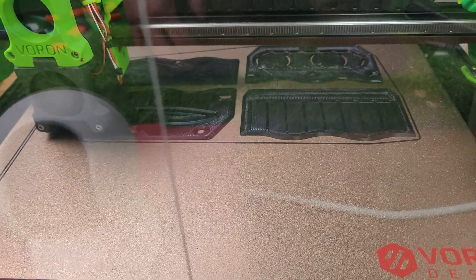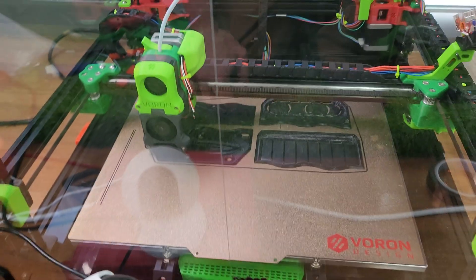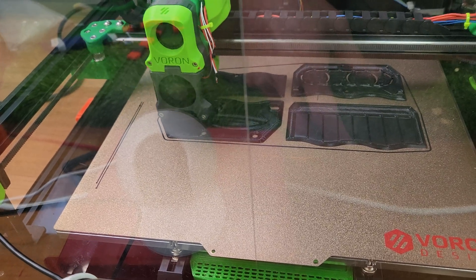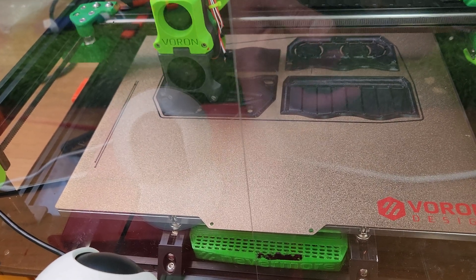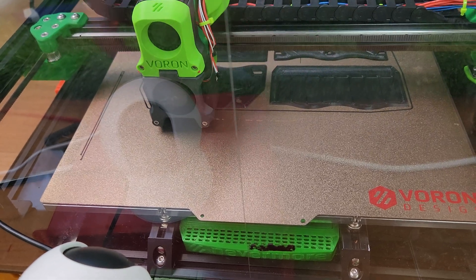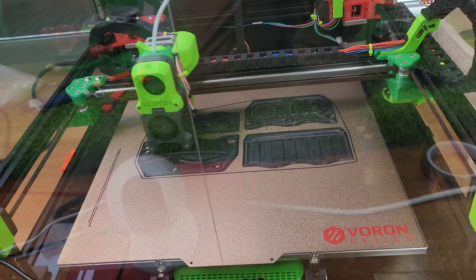Printing beautifully. I actually printed the Nevermore in PETG and it completely melted, so that's why I'm printing another one in ABS. I thought it wouldn't affect it that much, but before I was only printing PETG and TPU so my bed temperature was only around 50 to maybe 85 or 90 degrees. Now I'm running at 115 degrees for ABS, so I need a Nevermore that will stand up to those temperatures.